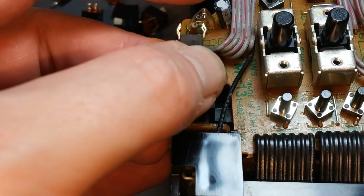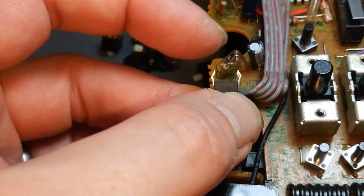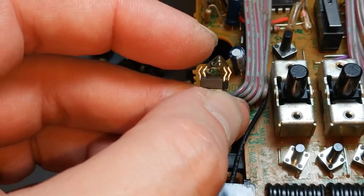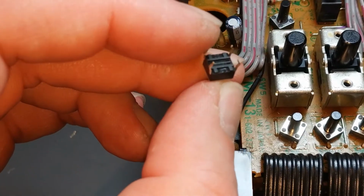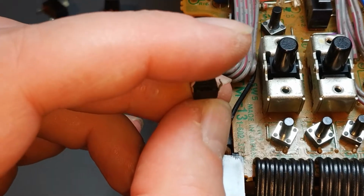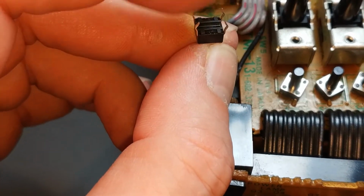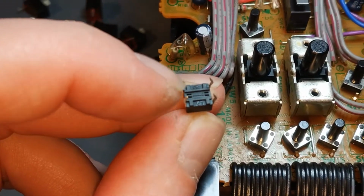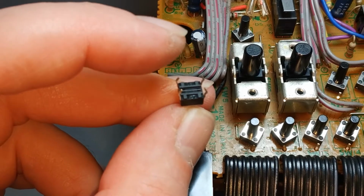You might have seen me test one of the switches just to make sure they are standard. But yeah, I've never known them not be standard. And so far as that, the contact is made from this pair to this pair. So breaking one of these off, so I break, say, that one and that one off, you'll still get a contact when the button is pushed across the diagonal ones here and here. And you can see there is a line sort of dictating there is a flow. If you think of that line as a flow when the button's pushed, that should help as well.